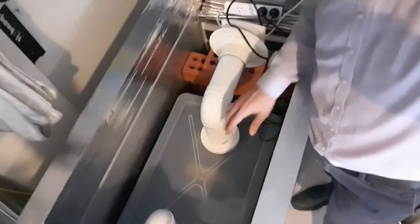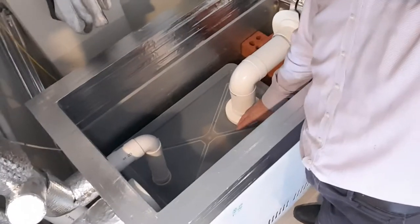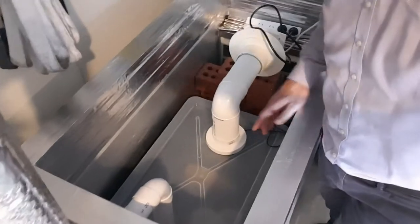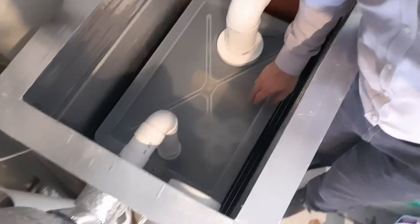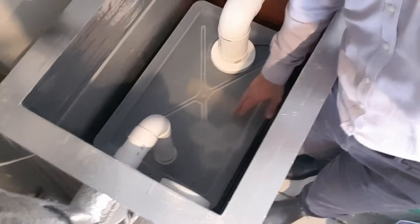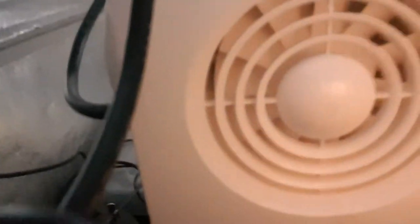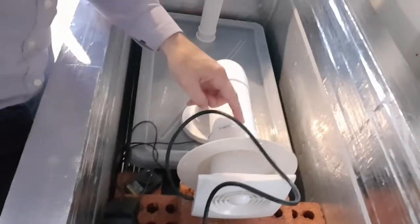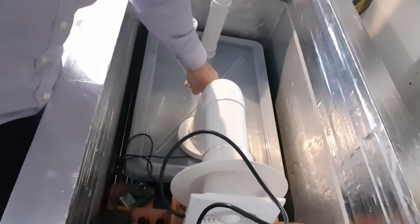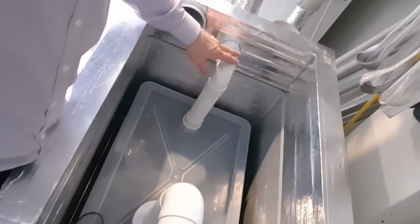Inside you can see I've got a plastic tote container that holds about a week's worth of water. Inside that container are three ultrasonic humidifiers — you can see them through the lid. That produces more than enough humidity for my fruiting chamber. Also in here there's a fan that draws air through this PVC tube — it's an extraction fan that draws air in, pushes it into the humidifying tub, and then pushes the air out of this pipe into the fruiting chamber.